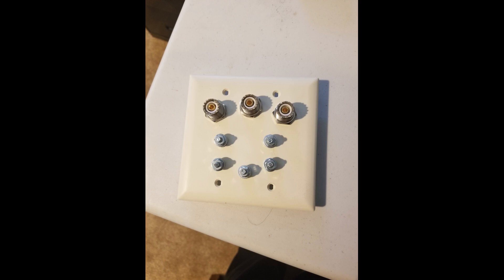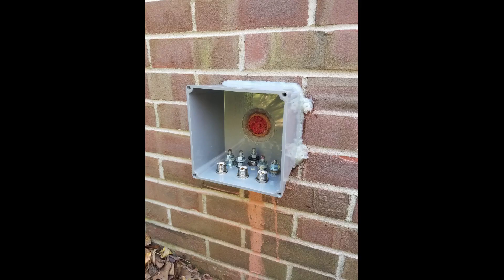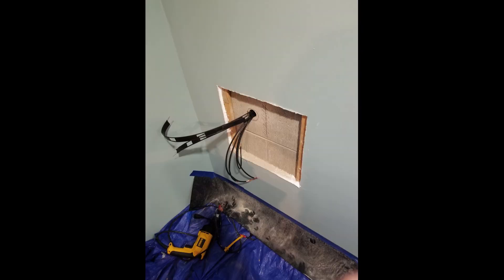I put the box on the outside of the wall. We were barely getting through the brick because I didn't have the right drill, but my brother let me borrow his and it started going through like butter. You have to have an impact-type drill and a masonry bit with diamonds on the end. Get with people that know what they're doing and get this hole built in your wall. These are the cables that came through the wall. I gave myself some room to work so if I ever pull the plates off, I'd have access to the wire.